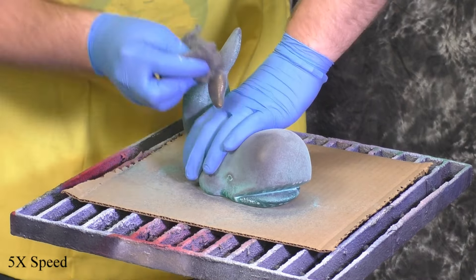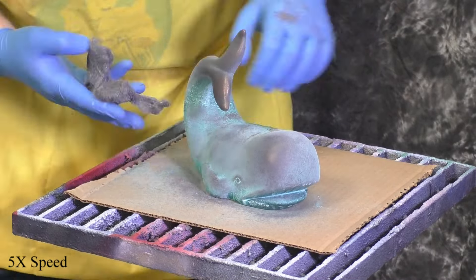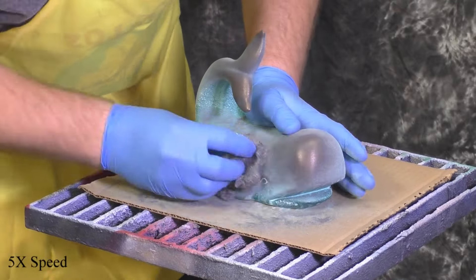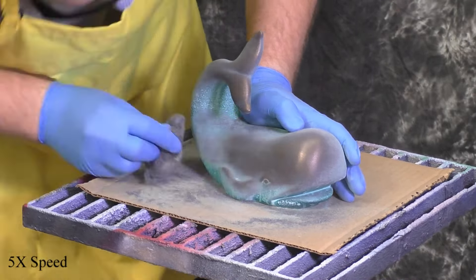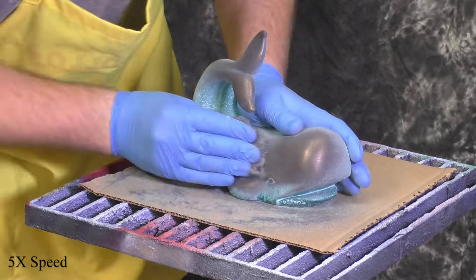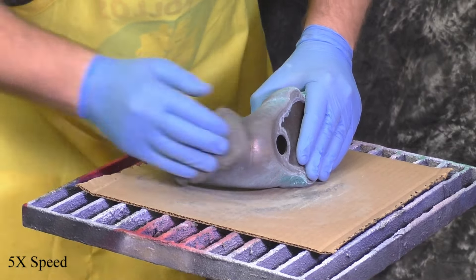This part of the video was sped up five times. For the whale, I went with 2-0 steel wool first and then moved in with 4-0 steel wool. The 2-0 will do most of the work as far as removing the patina and the base layer, but the 4-0 will polish it right up.